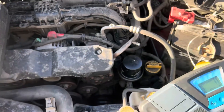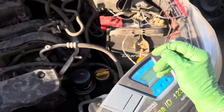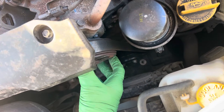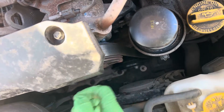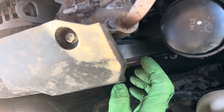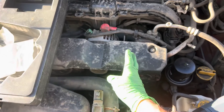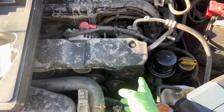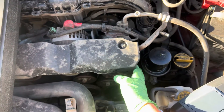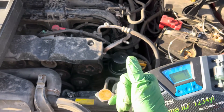For now I'm going to put my gauges on, do recovery, and do a vacuum. The customer mentioned he did his own research online and said to check the gap to see if a shim needs to come out. I looked at the gap and it's approaching the maximum of the range — roughly 11 thousandths to 26 thousandths is the range. His gap is still good, just getting up there but it's okay. Let's keep going and see what I find.